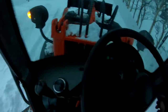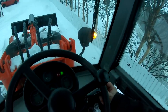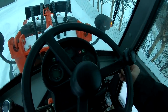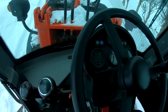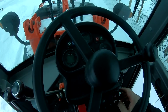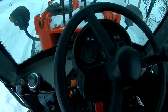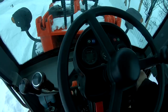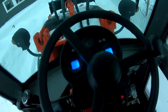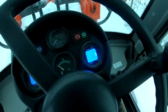Okay, so I see the lights are turning on. The blinking lights are not blinking, they are just lighting up. Okay, but I don't get anything here to the ignition. Like earlier, I had the blue lights and the voltage and everything. Not sure how that went away. Okay, so we can see here now we are only reading 12 volts, and as soon as I turn the ignition, it goes off.